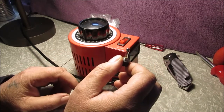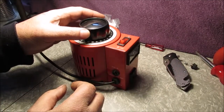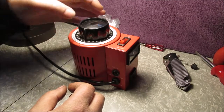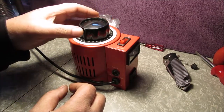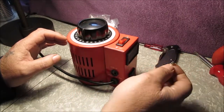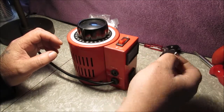It's only three amps actually. One thing with these - like when you hook your rotary Dremel tool - always start on low and speed it up. When you're going to shut off your Dremel, turn it down first. If you have it cranked way up, the surge can blow the fuse. That's what I learned the hard way, and that's why I ended up buying fuses. So that is why we're changing this.